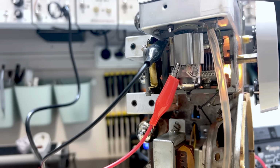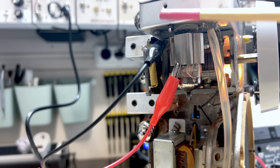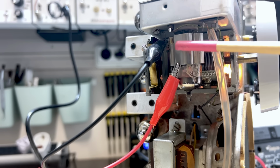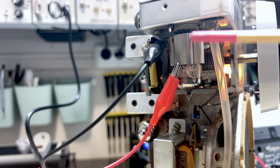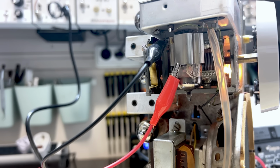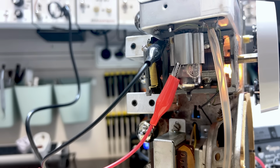And the signal is actually being fed to the shield around that FM tube. I desoldered the ground braid from the chassis ground to the shield, so the shield is floating. And the signal's going from ground to the shield, so it's getting induced, lightly coupled, into the tube itself. And the reason it's 10 millivolts up there, I don't know how much I'll need, but the reason it's quite strong is because this is a capacitive coupling, therefore I put it at a higher level.